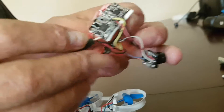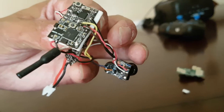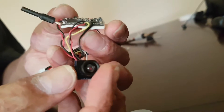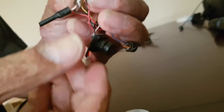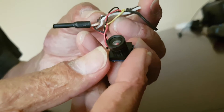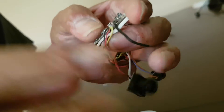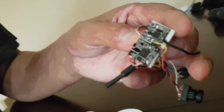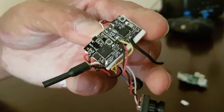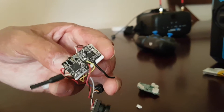Now this is the VTX-01S, the smallest 25mW video transmitter that I could find. I didn't like the stock 600 TVL camera that came with it, so this is the 700 TVL, 170 degree field of view camera — that's available on Banggood, I'll put links in the description. This is the Flysky FSRX2A Pro receiver, which is the smallest Flysky receiver I found available. It's good for about 300–400 meters; I've tested it to that range.